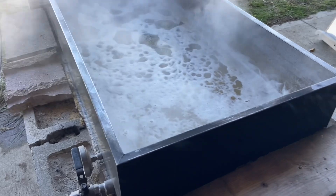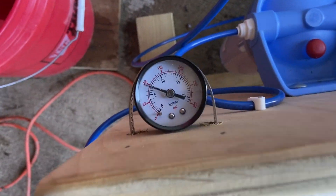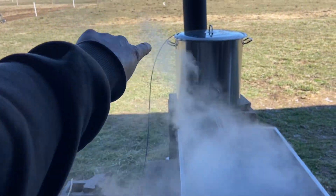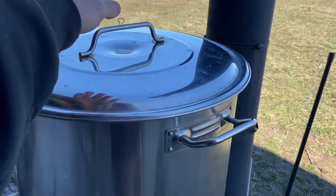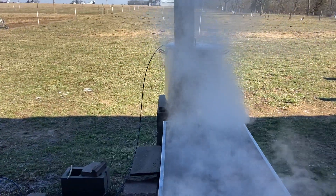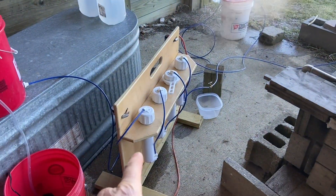You can see we've got everything going here. We've got our boil just above 200 — that's going to need a little attention, needs to be a bit higher on that temperature. And the RO is cranking here, just under 100 psi. We got the permeate water going into a bucket there. The junk side of the RO that puts out your sap is going right into this big pot here. We're going from about two and a half percent sugar up over seven percent sugar. After one pass through the RO, I believe it was like a 62 percent decrease in water.